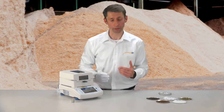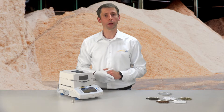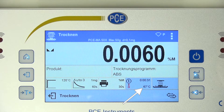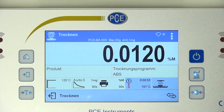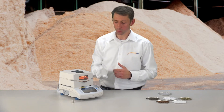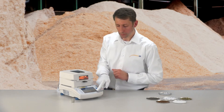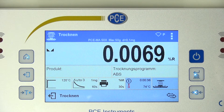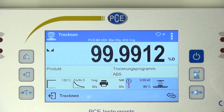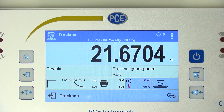This setting I can choose manually. I can also access measurements from probes which I have already done to compare. The next panel shows me that at the end of the drying I want to see the moisture amount of the probe. In this panel you can see the actual temperature of the drying chamber as well as the already elapsed time of the drying. During drying, the Precision Moisture Analyzer PCMA50X offers the possibility to see different calculation formats. Using the Shift key in the lower area, you can see the relationship of dry mass to total mass, the dry mass itself, the actual weight, and naturally the moisture content of the probe.